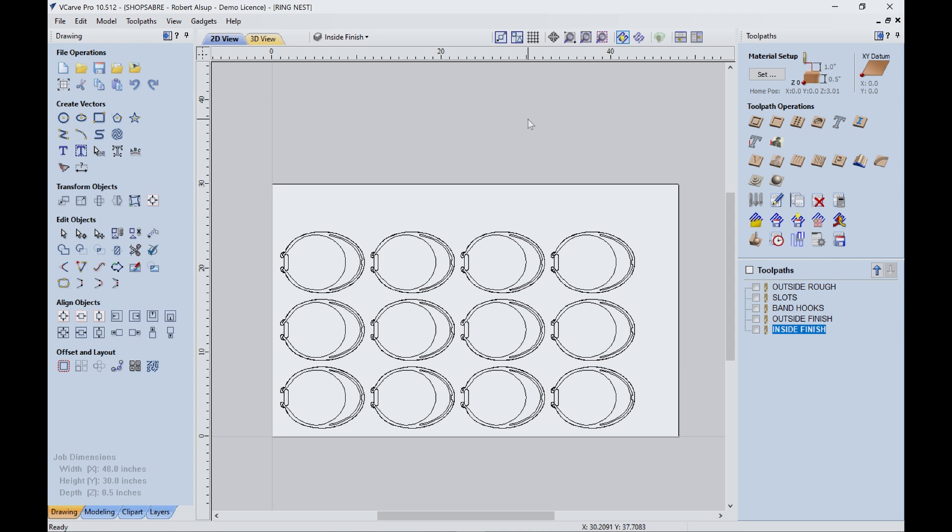Once I had done a prototype of the ring part and the face shield, I nested those on a sheet to cut 12 of them. The material is about four feet wide. On the machine I just used the front zone because I put all the vacuum there. We actually cut the front two ones first so we could leave the dust collector shroud off and you could see the cutting — that's what this first tool path does.